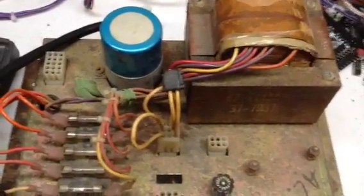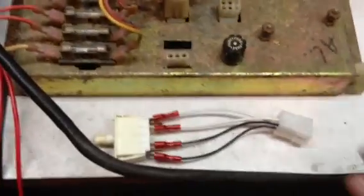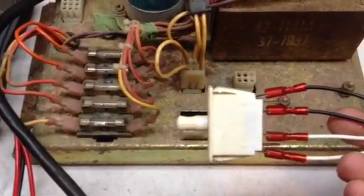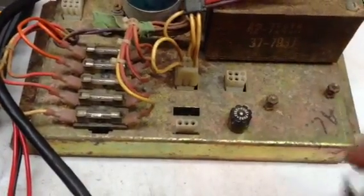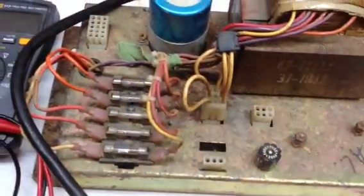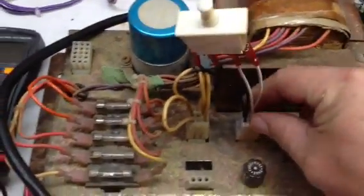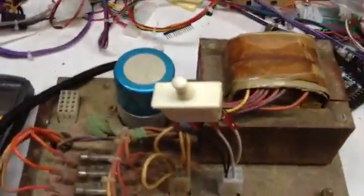I'm not a big fan of that — I've done it, it works — but the better way to go is to take your 6-pin and wire it into some form of a switch. I like to use a safety interlock because they're easy to move, rather than a standard on-off switch which can be kind of stiff. All you're going to do is plug this little guy into J2 and that's your new on-off switch.